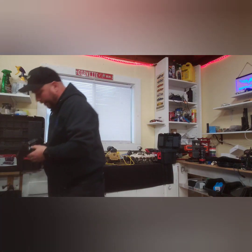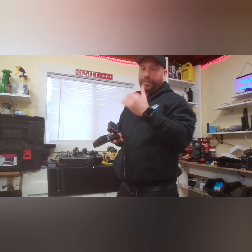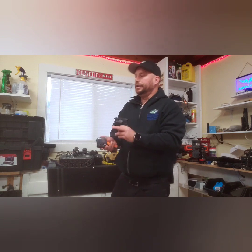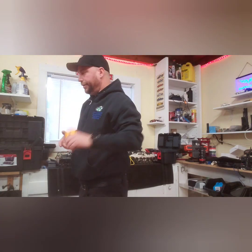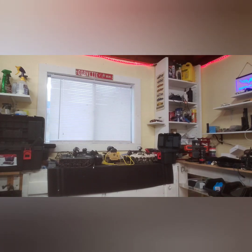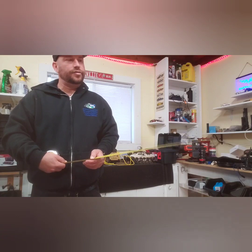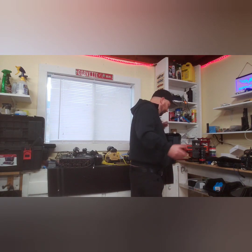Obviously we have electrical checkers. For two-prong outlets I have a tester for that as well. I also have a sewer lateral camera coming — I sent one back because it didn't have the transmitter on it. I like to use these GFCI testers because they'll let me know the conditions of the electrical. I also test temperature for fridges and freezers. And tape measures, because I want to show joist distance and deck tread spacing — for example, if it's more than two feet you can't use inch-and-a-half tread for wood.